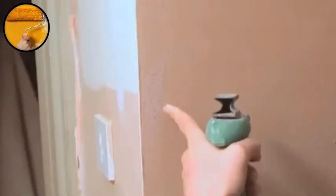We're just going to turn our attention now to the edges, because that's really important when we're patch plastering. Give it a little spray of water, so we just want to keep it pliable. And with this, I'm stroking inwards, so taking off any edge here. When we come to paint, you won't ever see this. If you can see that little bit there, I've just gone over it and it's ruffling up. That means it's too dry. So just a bit of a spray, we'll go over it again, and it'll disappear.